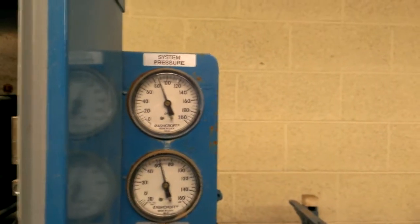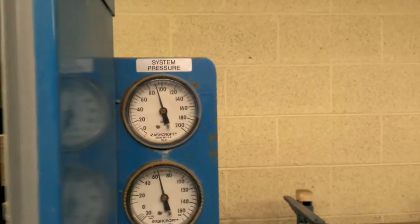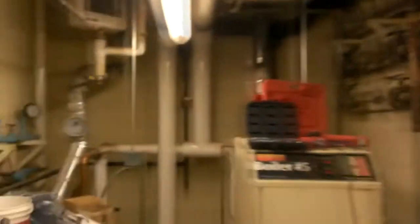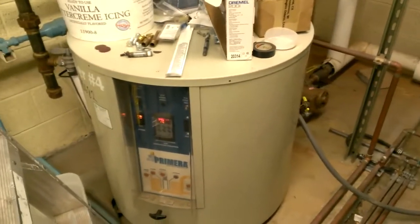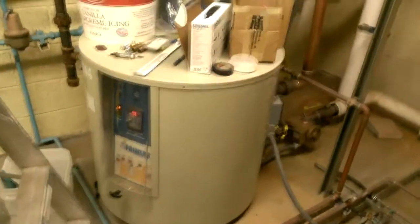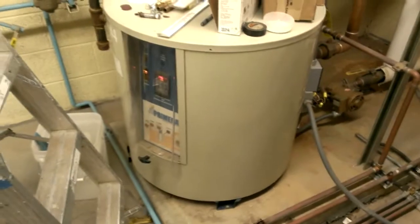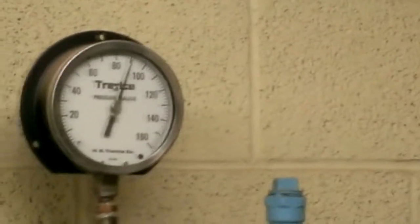The problem is it just drifts up to about 110 PSI building pressure because those regulators are all worn out. The VFD will take care of that. High pressure getting up to about 110 is causing this Primera boiler to open up the pressure relief valve. That happened several times on both of them in the other mechanical room too. There's nothing wrong with the units — it's the pressure. It gets up to about 110 or so and makes it overly sensitive to lift. It's over 90 right now, gets up over 100 sometimes. Regulators — it's bad.